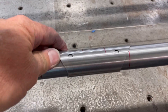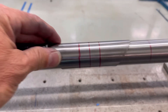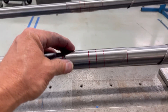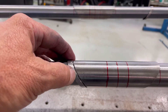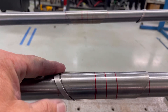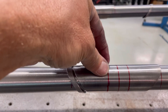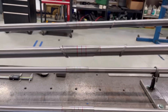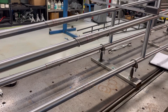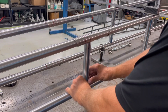Where the fuel tank sits, there's not going to be a cross member going across the lower rails. Per spec, you have to have a sleeve on top of it — it can be floating on one end or welded. The way I like to do it is to have the lower one actually solid and the top one able to float a little bit. I got it in place, made my measurement, made my cross member — and guess what? It was pretty damn close.